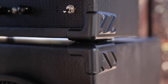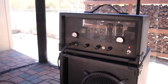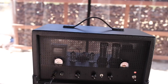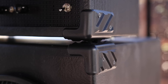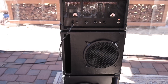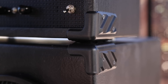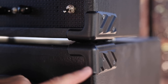Another thing I want to point out — I alluded to it last week when I was building my bass cab — but these amp corners are awesome. A sort of happy coincidence: my amp head turned out to be the exact same dimensions as my speaker cab. So I ended up using the rear amp corners of this speaker cab to put on the front of the head, and when I set it down it just beautifully locks into place and doesn't move around. Same with this cab sitting on top of the other one. These are really cheap — you get all eight corners for like $4 or $5. I think I'm going to be using these and that VU meter kit on just about every amp I build from here on out because it just fits together so beautifully.